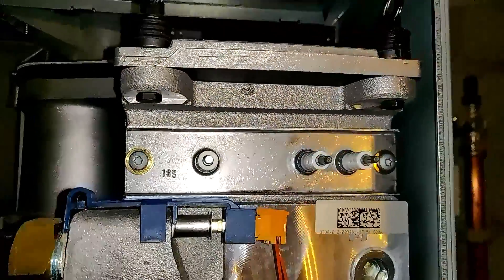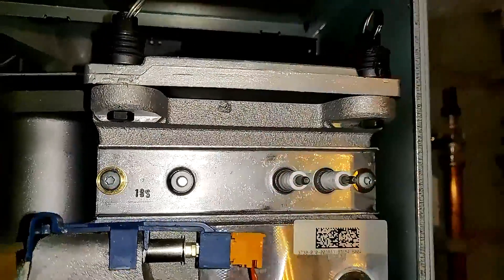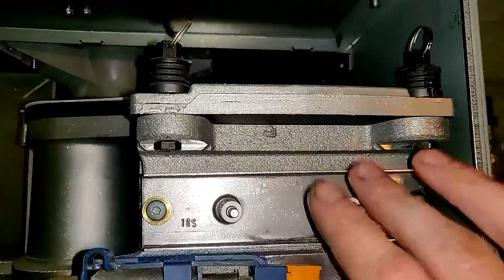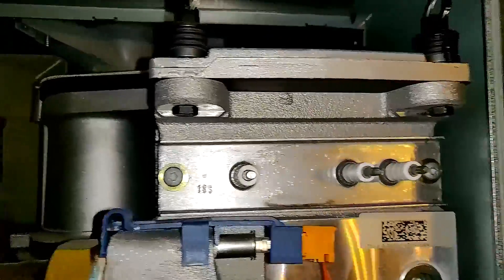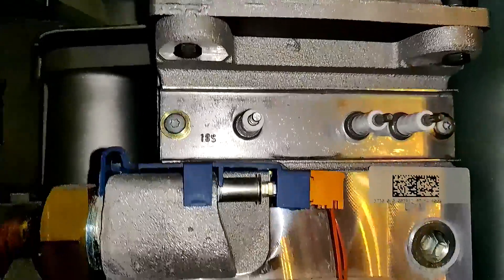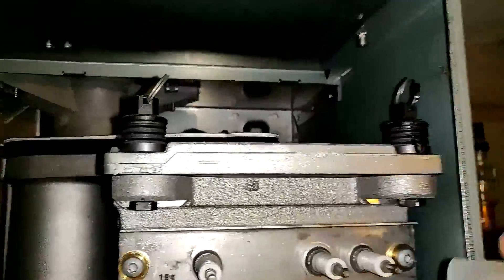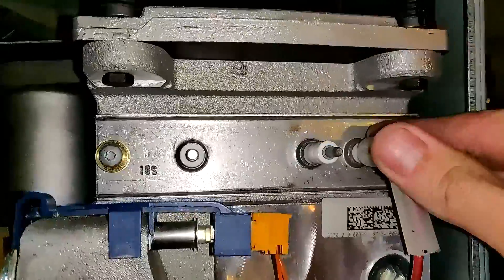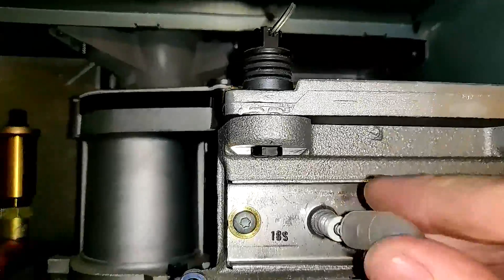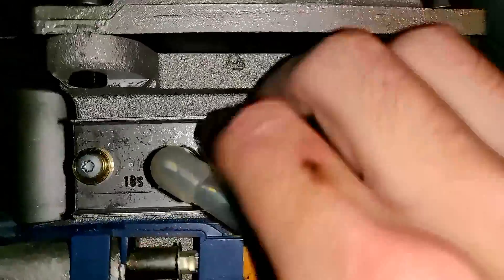It's a nice simple job, all sorted — literally two screws off, take it off, make sure the metal is clean, put it back on. And that's done — just put the electrodes on, tightened the screws up. What we'll do after this is get the flue gas analyzer on and we will test the boiler to make sure nothing's passing out of here.